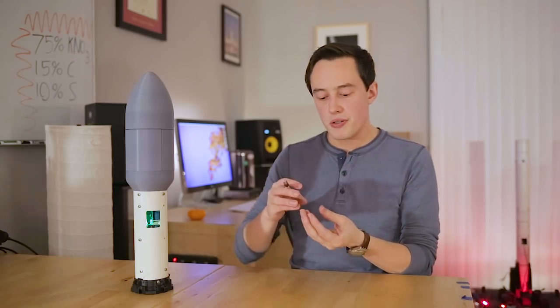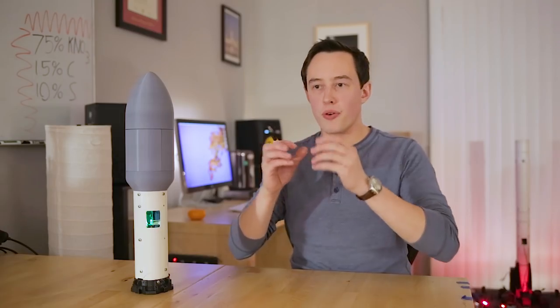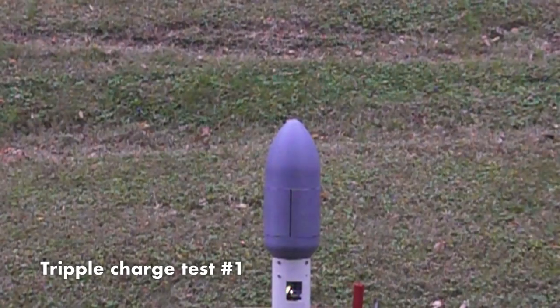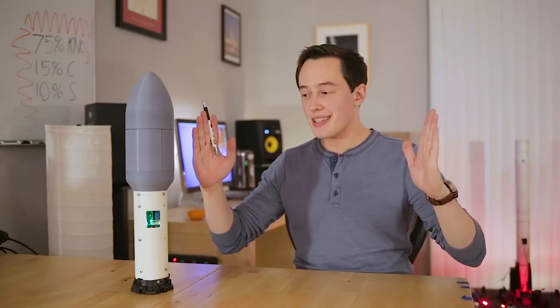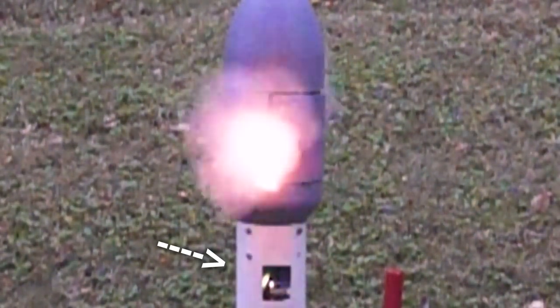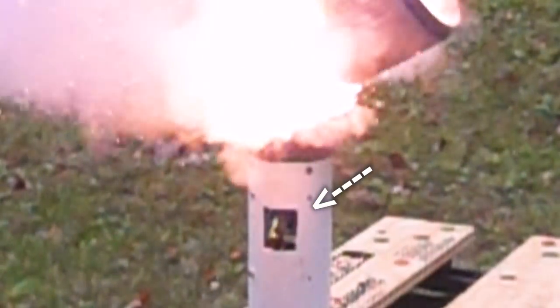So the black powder charges are enclosed in this little heat shrink tubing, and they sort of come up to pressure before they explode and put a bunch of gas inside this fairing. And you can see that delay, which is stretched all the way out to one full second. That's just 20 milliseconds. That's become 1 second in the video here. So when the signal light turns yellow, that means the electricity is being sent into the pyro charge. And then you can see when the gases start exiting the fairing afterward.